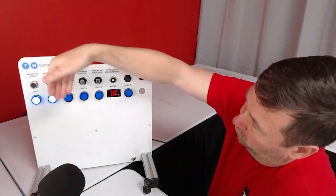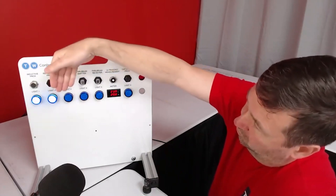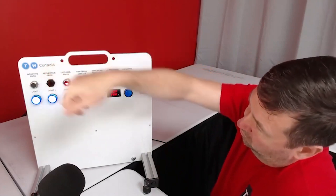Diffuse has another variant called background suppression. Background suppression basically lets you adjust where the switch point is — closer or farther out. A lot of people use it on a belt, pointing the sensor down so they don't detect the belt but do detect the object on the belt. Diffuse is common but it's the least reliable, though it's the simplest to implement because you only have one component to mount.